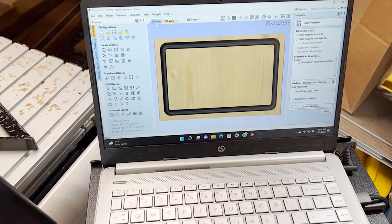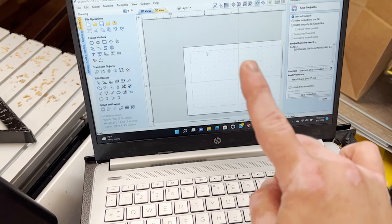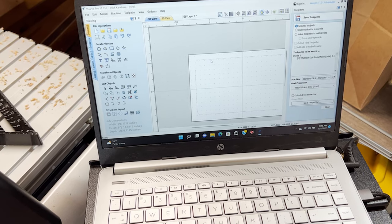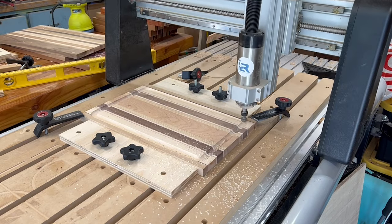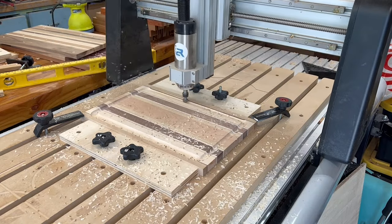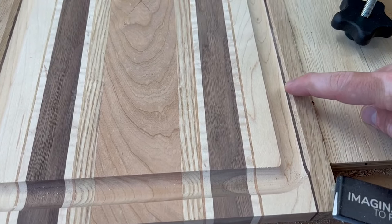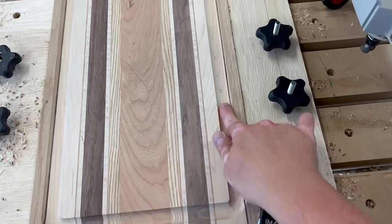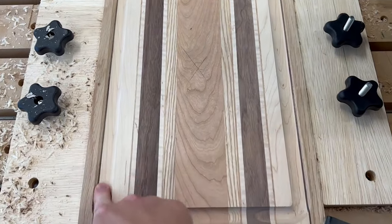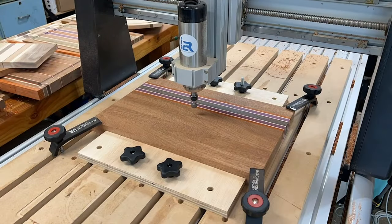You can see that dark walnut line is not even — even though I said to be secure it wasn't perfectly aligned. One way around that: go back into V-Carve, take the rectangle, and just bump it over a fraction, then rerun with the same settings. It'll only cut on the uneven side, making the juice groove slightly wider, but the lines will match. With different wood species in the glue-up, it just looks better.